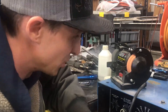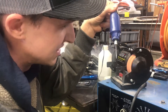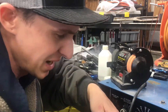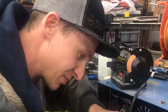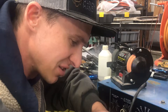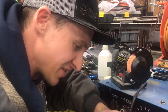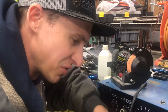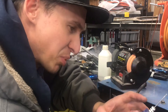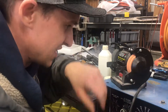Using the Dremel in a downward motion is definitely wanting to pull the tungsten out of the collet. It's as tight as I can get it by hand without tools. Occasionally it feels like it wobbles out of balance and seems to be running too fast. I'm holding my finger on the collet to try to slow it down — that helps a little, but it just doesn't seem to be doing what I'd like.